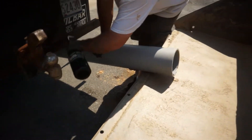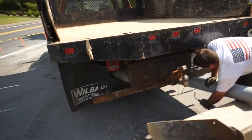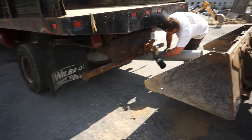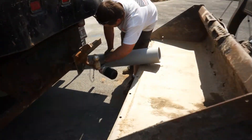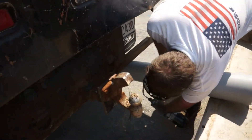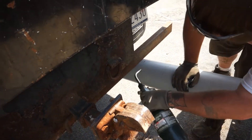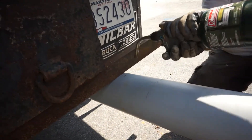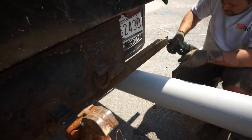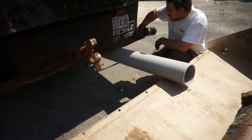We need to make one more bend on it. We've got it under the dump truck right now — you can see we've got it under the truck. We're going to lift it up on the Bobcat about two inches. June's just going to keep going around that thing and heating it up evenly. You'll see that little ripple come on the top of that plate right there, and it'll set itself right into place. This is how you bend big six-inch schedule 40.